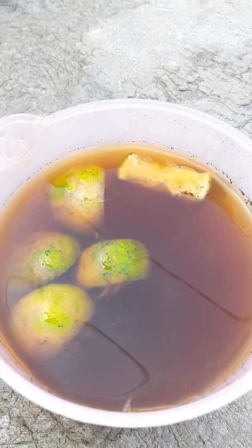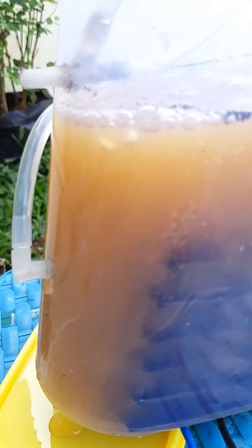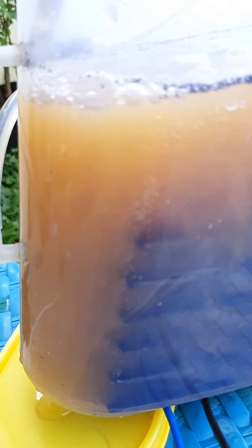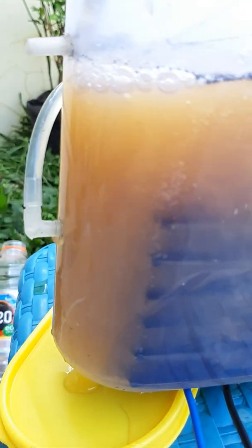It's oxidized by the electrolysis. I'm trying to configure the right amount of catalyst in there, and I've been running this for about 10 minutes. It's stable. My power supply will automatically shut off if it supplies more than 10 amps, so I'm trying to find the best concentration for the catalyst in my setup.